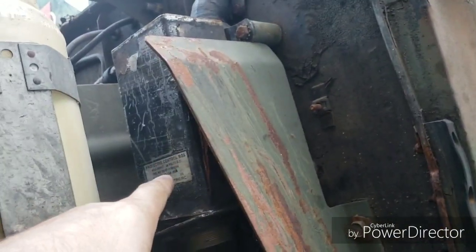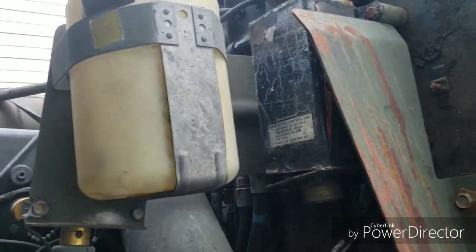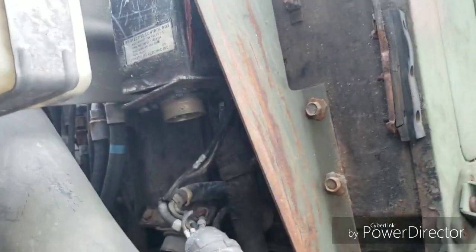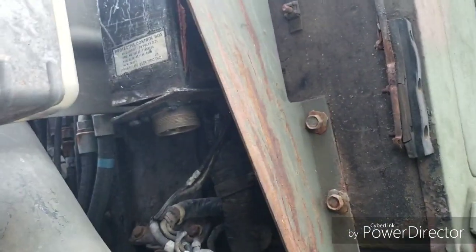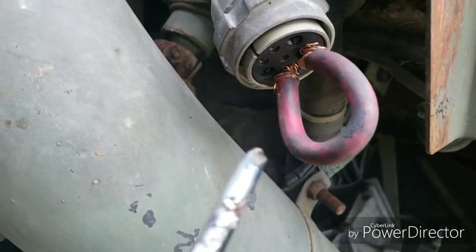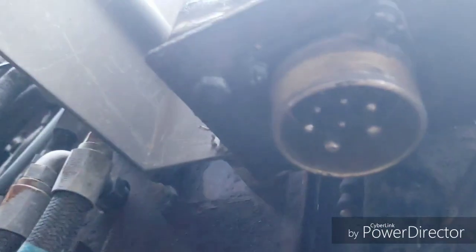This one here has an 800-series box but it doesn't have ABS — a little different. First thing you can do is smack it with a hammer, hit it as hard as you can and see if it works. Usually it does, especially if it was hot outside and then went cold overnight — that's what usually happens. Worst case, keep a large jump wire — about 6 to 8 gauge — handy. Plug it into both big ports on the box.